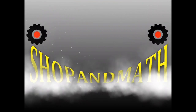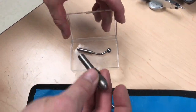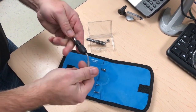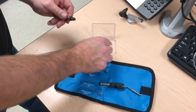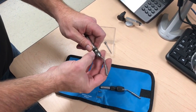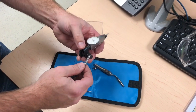Let's get started. We have two different styles of wigglers. This one here is a new modern set and this one is an old set — a Starrett, actually a really good quality one. To load this wiggler, we'll load the indicator one first. All you do is just push the ball in and it clicks into place. This other one has two features: you can store one inside and then put the ball or piece through here, then just screw it in. They're both basically the same, but this one's a quick changer and they both attach to your indicator.